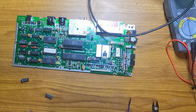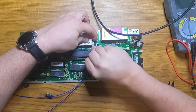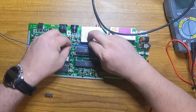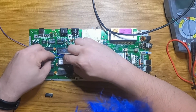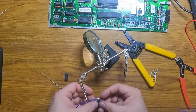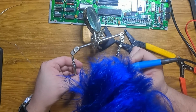Eventually. I learned in this process that crimping connectors is not as easy as it looks, and I just decided not to film me getting extremely frustrated with all of that. So here we are after the fact. We'll route the wires around the board, and to where the multiplexer's pins are going to be that we've pulled out. Since I've got spares of all of these multiplexers, I'm just going to solder straight to the pins and call it a day.